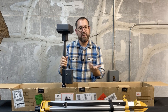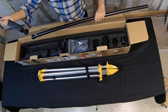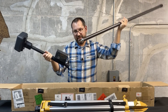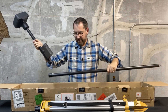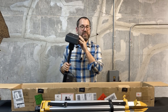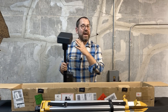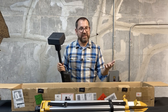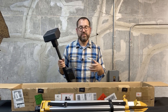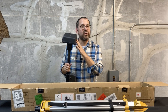Here we have the top of the base station — this is the standard base station that comes with the other DJI RTK for RGB. There are two pieces that just screw together. This one has a precision point at the end that slides into the tripod, and the top mounts onto it. This has the RTK antenna, which does real-time kinematic corrections — correcting for atmospheric distortion and timing differences that can skew GPS data tagged onto your photos. Standard drones are off by a couple of meters; this corrects that to a couple of centimeters.